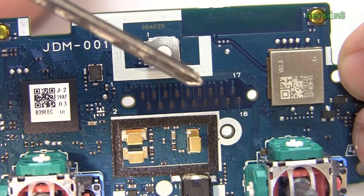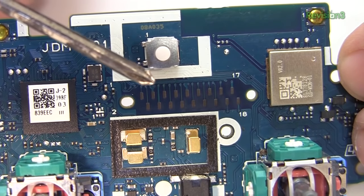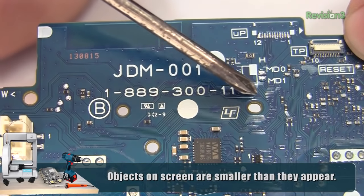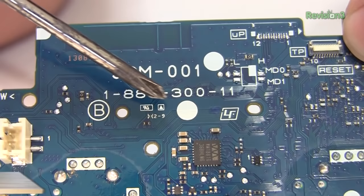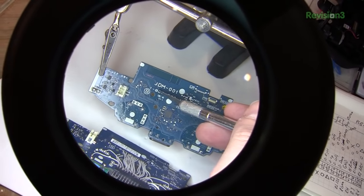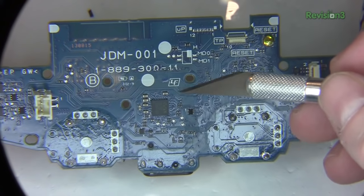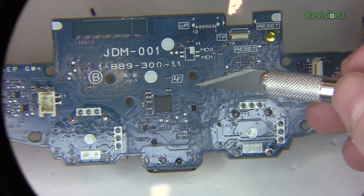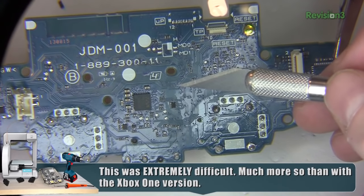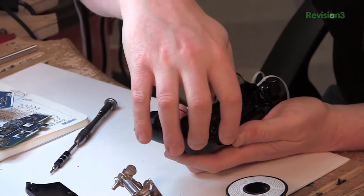These are the contact pads for the silkscreen-printed face button circuit. What we need to do is connect to these small vias on the other side of this circuit board. On the reverse of the board we can see the vias — of course, they're right under the silkscreen so we can't really see them. What I've got to do is scratch the solder mask off and make contact to them. I carefully scraped the solder mask off the vias that I needed, then tinned them with solder so they will receive wires, then cleaned up the solder mask. We need four vias for the left triggers — L1 and L2 — and four for up, down, left, and right, because those are the things we're going to move from one side of the controller to the other.